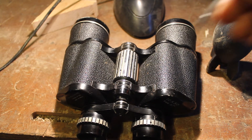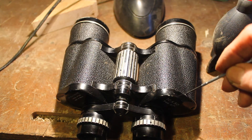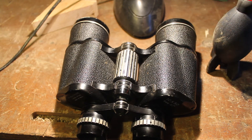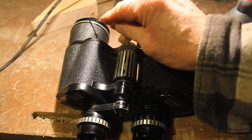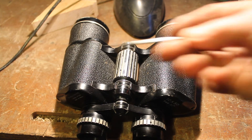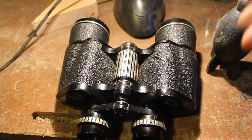What I'm going to need to do is adjust these two screws on each half of the binocular to alter the angle of the prism on the prism shelf. Then when I've got it near enough right, I'll correct the final small bit of misalignment by adjusting the objective lenses with the quick method. The problem right now is there is both horizontal and vertical misalignment. The eyes can adapt quite well to slight horizontal misalignment, but vertical misalignment is incredibly hard for the eyes to cope with, so I've got to correct that first.